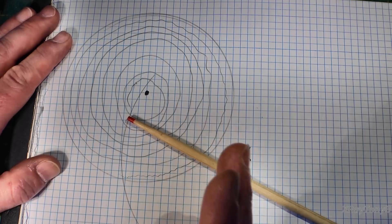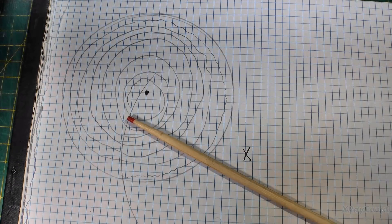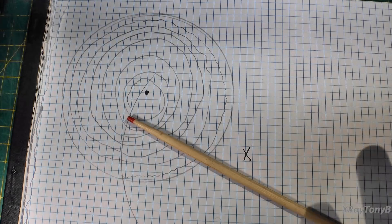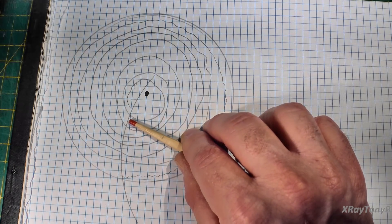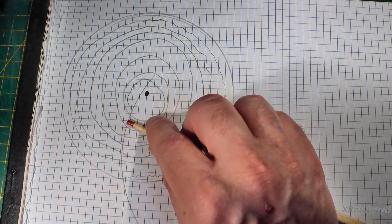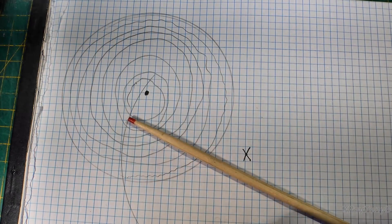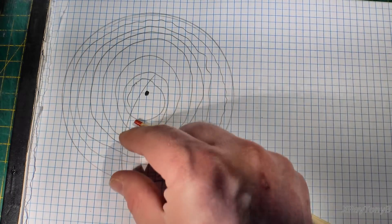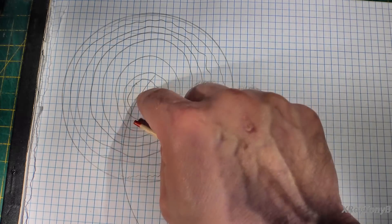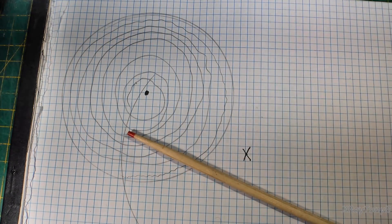But really, the true definition of distortion in audio is anytime the output is changed from the input - that's called distortion. An amplifier should completely amplify the signal without changing it in any way; any change is going to be called distortion. Because you're not perfectly lined up with the groove at certain points, one side is going to have more influence over the stylus than the other, and that is distortion. By aligning the cartridge such that you have two null points - a little way in from each end - you'll have different regions where it'll go in and out of accuracy.